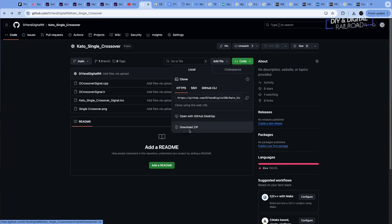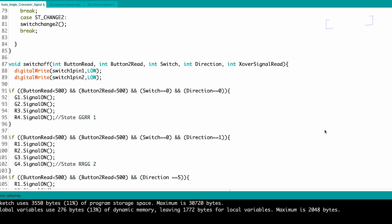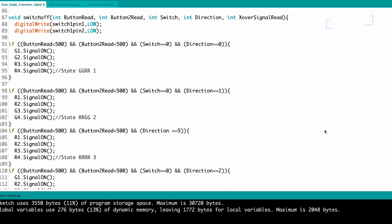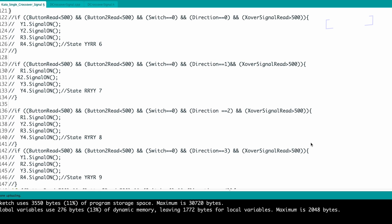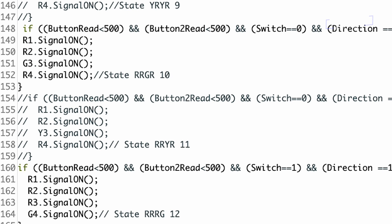The diagram with the Arduino sketch is on my GitHub page, linked below. Before I talk about the Arduino code — know that you can download this entire project at the GitHub link in the description. It includes the libraries, and this project uses the library I created for the double crossover. Libraries are packages of code that can be called upon to increase the Arduino's functionality. I have an if-then statement for each possible scenario. I've also made several versions of the code that allow signals from other crossovers and sidings to come in and change the signal — for now those lines have double forward slashes making them comments, so the program ignores them until I have the signals connected.